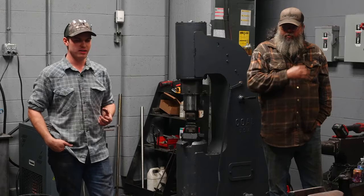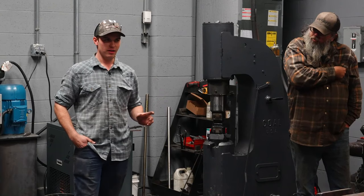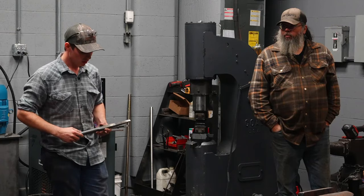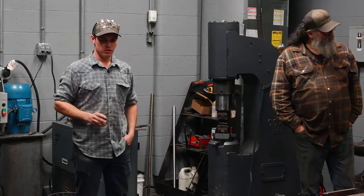This hammer is gonna take, like I said, outside of punching the eye, because I can't put a number on that. It's done when it's done. Right? Your striker's gonna strike a little harder, a little lighter. Piece is gonna be hotter, colder. You can't put a number on that. So that's out. Releasing it off of the drift and upsetting it, we also can't put a number on, because there we're looking for a certain form. I want to shorten it, I want to forge the ends of the eye, and you'll see all this later. So subtracting those hits, this is gonna take 102 hits. And it's going to take 10 heats to do. So it's 10 heats, 102 hits, and this is a 3.5 pound rounding hammer.